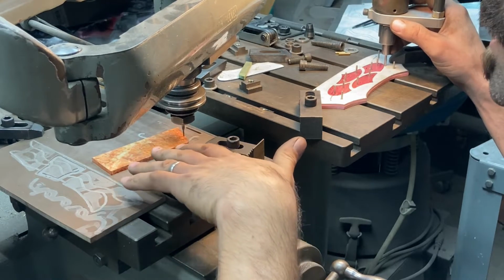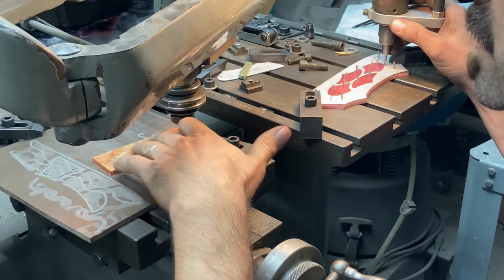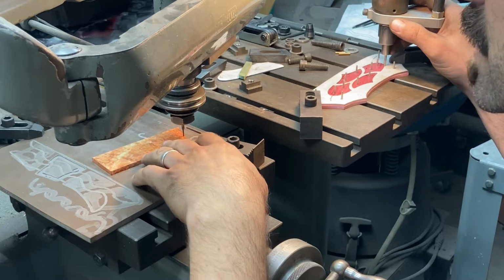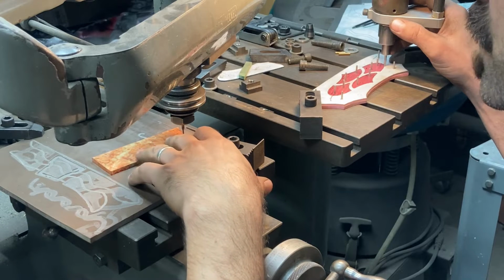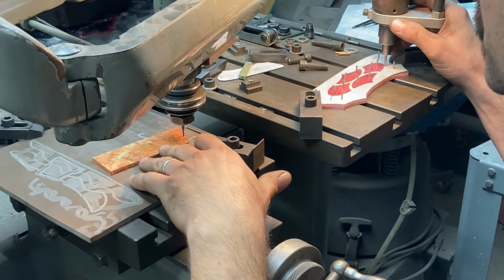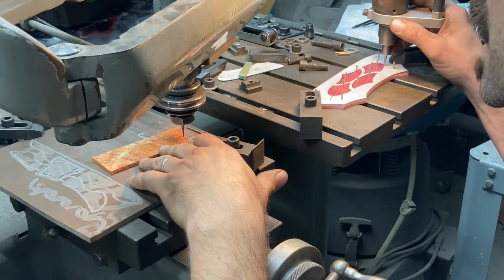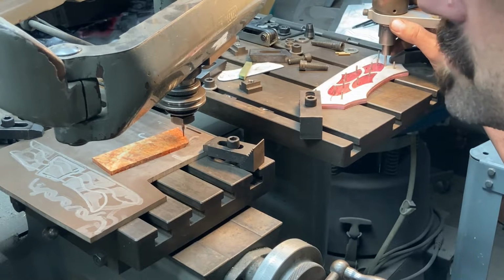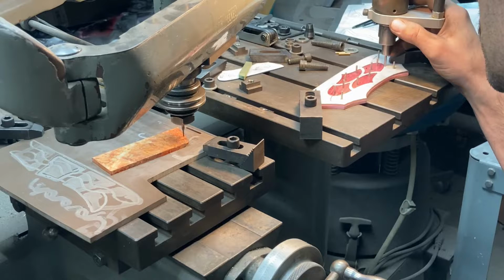And then I put a grid basically all over the back of this, small super glue tacks, so that whenever I break a piece free as I'm milling it, it doesn't break the surrounding material free, but also each piece will have probably a couple of super glue tacks under it holding it down until I'm done milling it, which is also important.